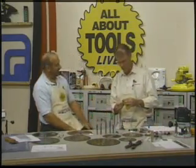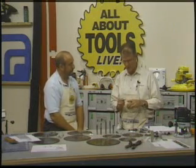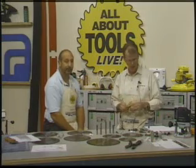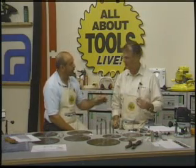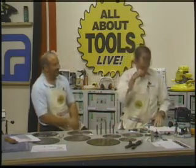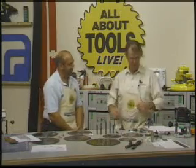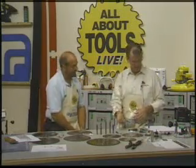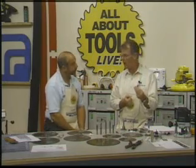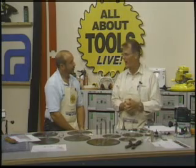You want to make sure, once again, but really, John's right. You want to make sure that you get the shank fully into the collet. Very important. Otherwise, you're not fully taking... penetration is critical. So, anyway, pay attention to your collet. Your collet is your friend. That's right. Treat it well. But you want to make sure that the bit is fully inserted into the collet. Otherwise, the collet won't hold the bit. And if it doesn't hold the bit, then it's just going to fly out, and you've got a problem.